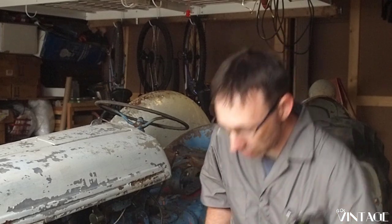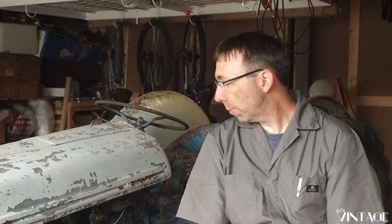So the solution I ended up coming up with is going out and buying a big 4x4 and making my own jack stands. Those seem to be pretty stable. I actually have Josie up on them right now. Been up on them for about 24 hours now with no problems, so I'm pretty comfortable working around it. We're going to leave the jack in place as a backup, just so that we're totally safe underneath there. We don't want any mishaps here. So let's get back into it and start getting these wheels off, draining out the fluids, and maybe even start tearing apart the back end.